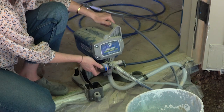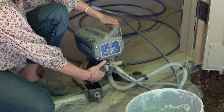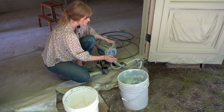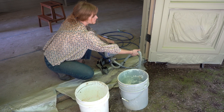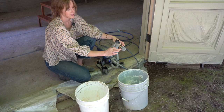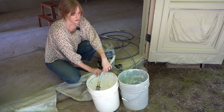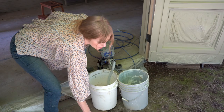To make adjustments while you're painting you use this knob for increasing the pressure, but you do all your priming in the start mode to get going. Fill your clean water bucket. We have two tubes — the intake suction tube and the waste tube. We'll fill the bucket up and I'll show you how to prime it.